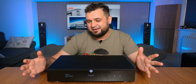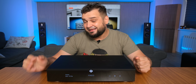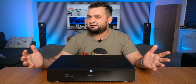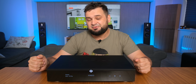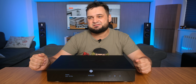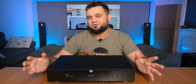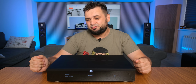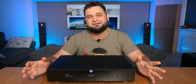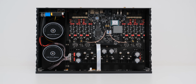Under its hood is where most of the magic happens. Now, as I have mentioned multiple times by now, a flagship ESS Sabre silicon like the ES9039 Pro that is sitting inside, like the ES9038 Pro, can be used differently. So you can use it in 8-channel mode, basically paralleling channels for a balanced output with a slightly better signal-to-noise ratio. You can use it in 4-channel mode or in balanced mode. You can use it in 2 channels, so basically stereo mode or single-ended output, or you can use it in mono mode for the very best signal-to-noise ratio and for the very best dynamic range.